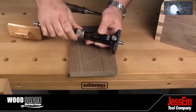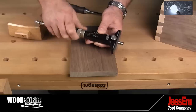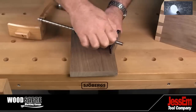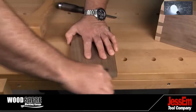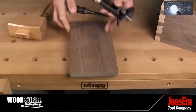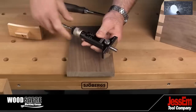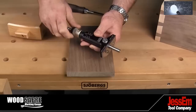The sight window on the side of the gauge has engraved lines every 1/16 of an inch to show your exact position. The scale on the side of the spindle allows you to dial your blade down to 1/256th of an inch. The large bearing surface on the gauge enhances your ability to control the blade while scribing a line. The gauge can be readjusted quickly for a second line for mortise and tenon work or to scribe a line for both sides of a dado.